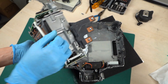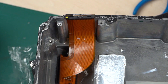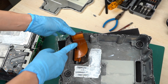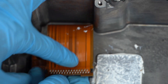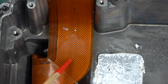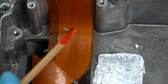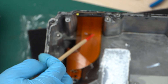The main component of this inverter can be detached as a whole unit. Here is a flexible circuit. On the outside, there's the input connected to the flexible circuit. Other units of the vehicle send signals to control this inverter, and those signals come through this circuit. Right next to the flexible circuit is the inverter with large current flowing. On the backside, a meshed ground plane is used. The mesh pattern is used to control characteristic impedance — changing the tightness of the mesh can control it. The usual way is to change the thickness of signal traces, but instead this circuit uses the mesh. It's bent and squeezed into a small space and has to bear the vibration of the car, which may be why the mesh pattern is used.